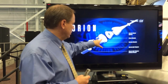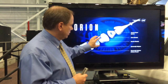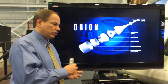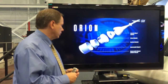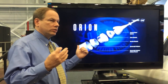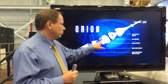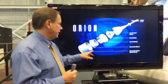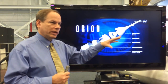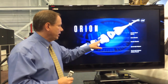We had CDR this year for the EM-1 and EM-2 vehicle. Below that is the spacecraft adapter, which is attached to the SM. Between this being mated together and being attached down here, three shrouds fit around this structure to protect the inner piece. This allows you to protect the vehicle during launch from loads and acoustics, and allows you to jettison them before you get to your translunar injection burn, so you're basically getting rid of mass going into space.